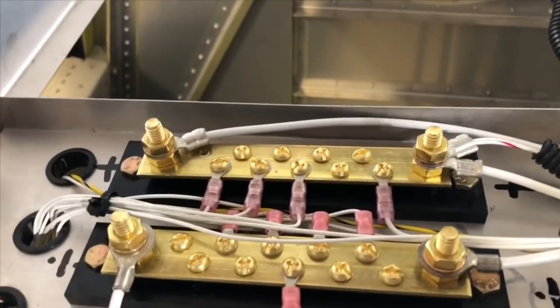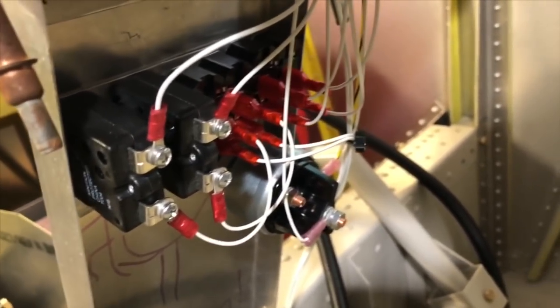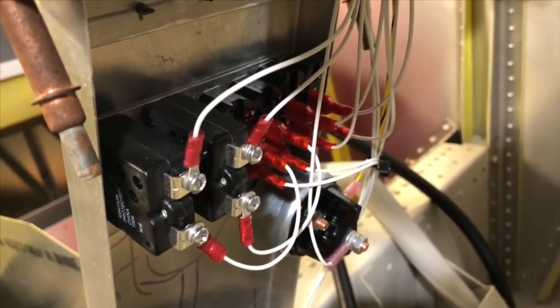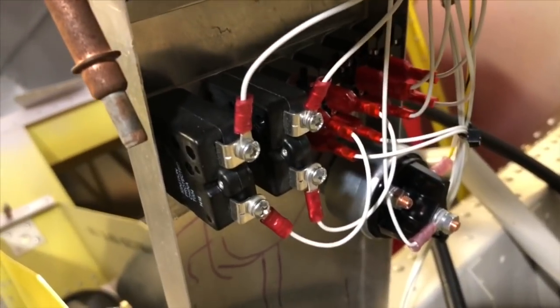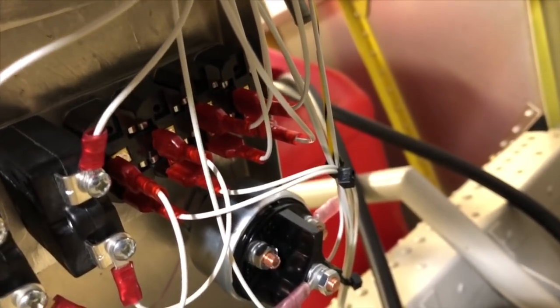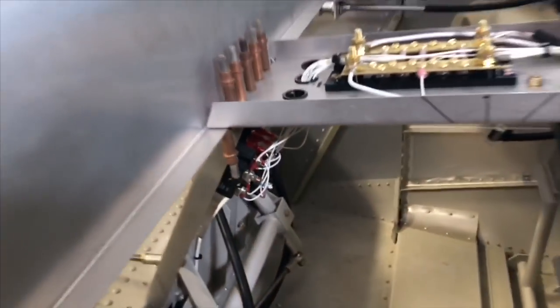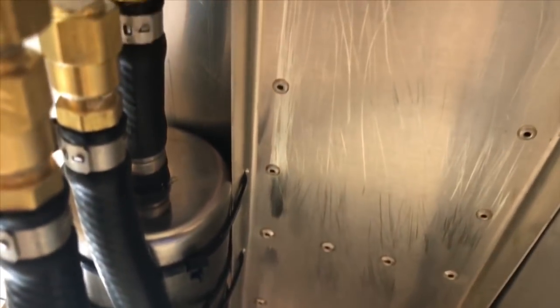So that's the wiring. Now we're getting into the fuel pumps. You're picking up two wires from your positive bus down to your fuel pump breakers — one for one breaker, one for the other breaker. After you install those two wires, you take two more wires from the other side of the breaker and jump over to your fuel pump switch. After you've completed those two wires, you go from the other two terminals on fuel pump one and fuel pump two switch, and you wire them down through the hole in the floor to your fuel pump system. This time you're wiring up the positive wires rather than the negative wires. We have now bundled that up, tie-wrapped everything, and the wires are following the hoses right up through the floor into the cabin.